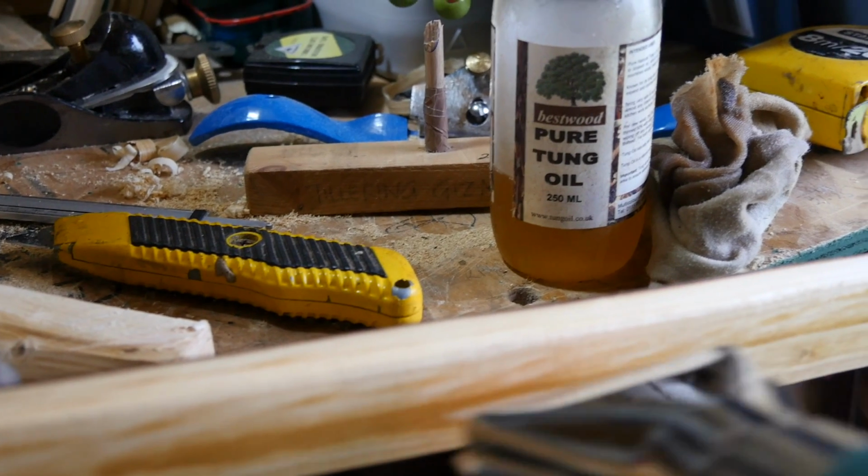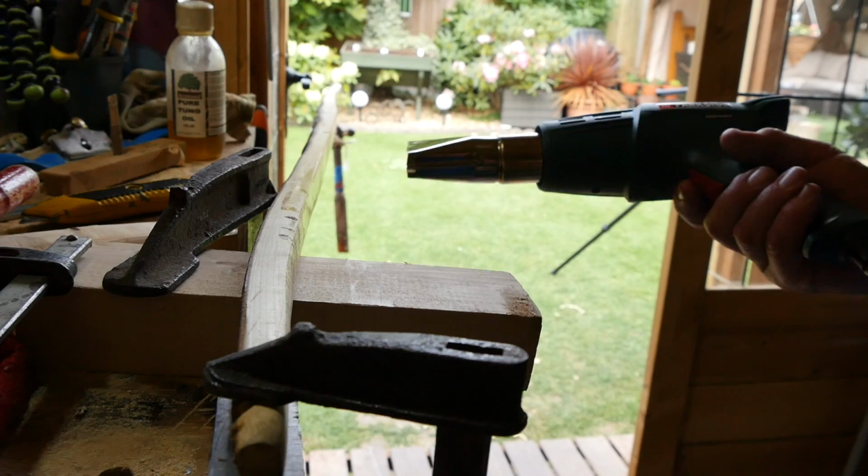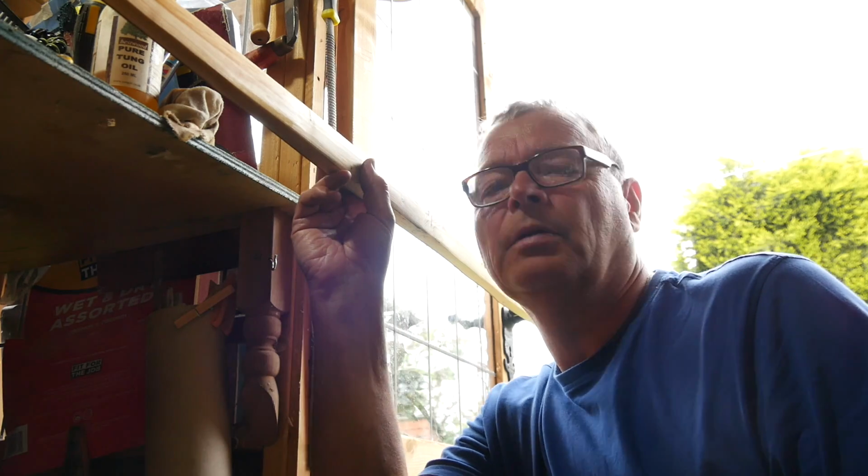I've coated the area I want to bend with some oil. I've clamped this end of the bow, there's a weight that end, and on here there's a block of wood over which it's pivoting downwards. The aim being to heat this limb and the weight gradually pulling the stave into line. I've got to wait now until tomorrow morning to see whether this heat bending has worked.